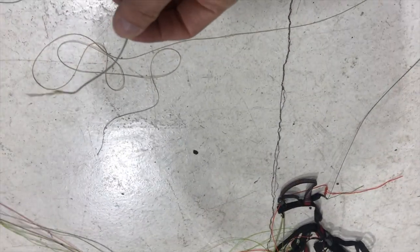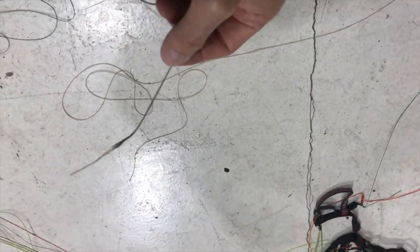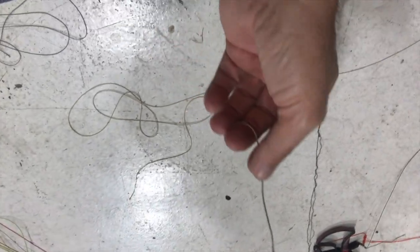So like most gliders, the Mac Para Colorado came with a field repair kit that had some spare lines. Here's the broken one, and I'd removed it from the portion that ties the 2D steering out to the end of the brake handle, and I replaced it by threading through this repair line that's longer. In fact, it's too long. And I was going to tie the two together. There's the rest of the wing up there.